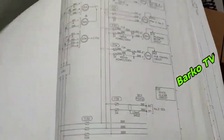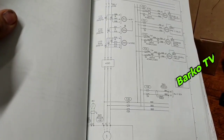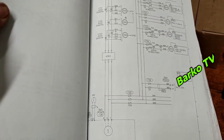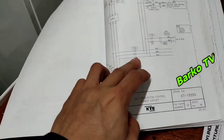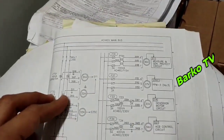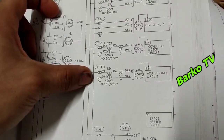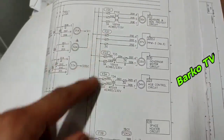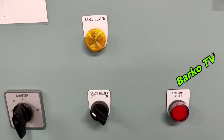The fuse is 10 amps. At the top is the ACB, and at the side is F30 — that is the fuse for the control circuits. We need to disconnect and remove this fuse to isolate all control circuits. This connects to ACB control, governor, and PPM3, which is for our PMS measuring circuit. That is why we need to disconnect it. The fuse is already disconnected.